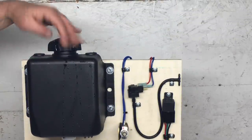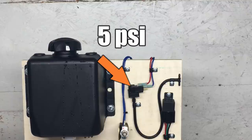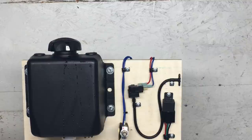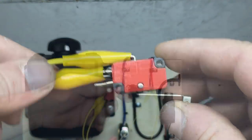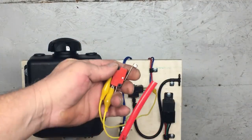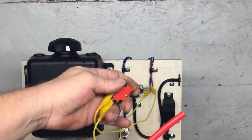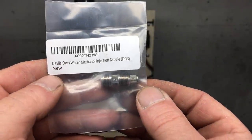Full disclosure — I have absolutely no idea what I'm doing. Right away, we have a problem. This boost sensor is set to go off at 130 kilopascals, and when it sees that pressure, it'll flip a low current switch and in turn trigger the high current pump relay and the process will begin. In our bench setup, we don't have boost to trigger the sensor, so we're going to have to bypass the sensor with a little switch. Yep, I reckon it works, but that amount of boost juice would hydro-lock most engines, so now we need to install a misting nozzle.